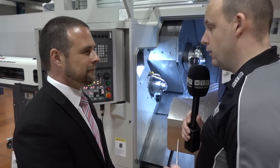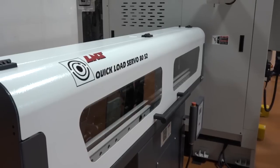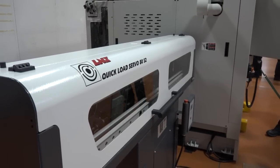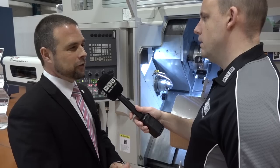What is the size of the bar you can run on this bar feed and through this machine? On the MT100 it's 50.8mm. They will do an option for a larger billet size. If you want to go bigger, then we do the MT200, which is 65mm bar capacity with the option of 80mm on an A28 spindle nose.